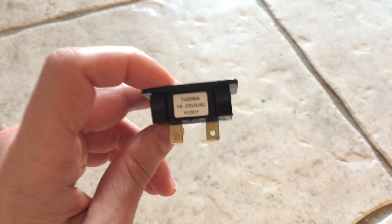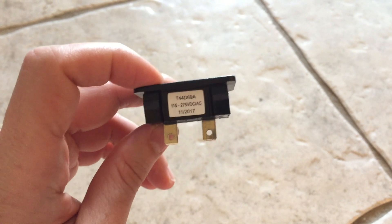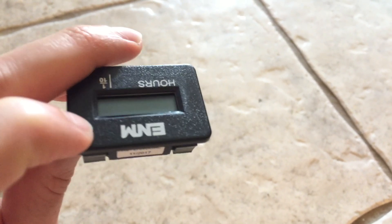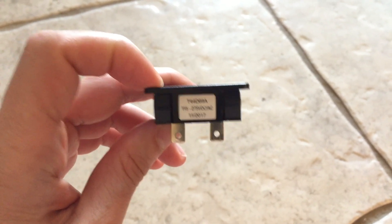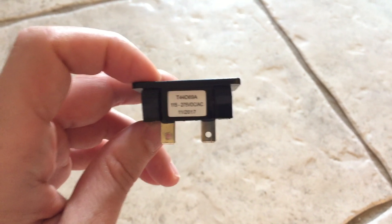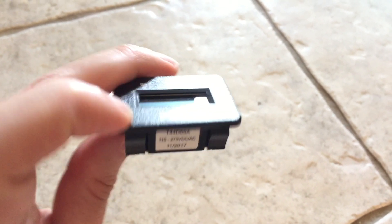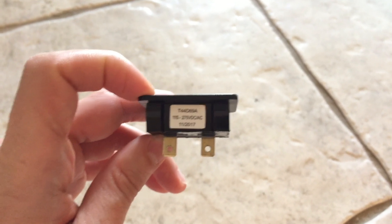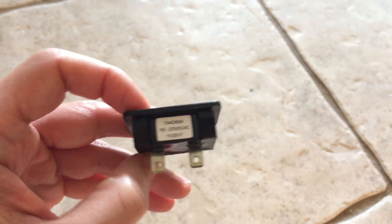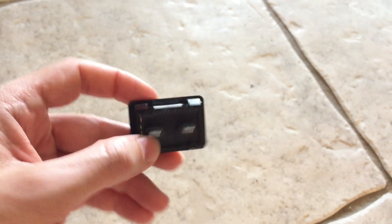Here you can see a few of the specs of the hour meter I'm using — the model number and that it's good for AC and DC. This is a panel mount unit, meaning I'm going to have to cut a hole into the unit somewhere with a Dremel tool. If you don't want to modify the case at all, I think this vendor E&M makes a version you can stick on to the top of the unit. But I decided to cut a hole and go with a panel mount so it's flush on top. This is a sealed unit — it is non-resettable, meaning you can't set it back to zero. So once it's hooked up and installed, it's there for good. The downside is that to view the number of hours you have to run the generator — there's no way to turn this on unless the unit is running. The upside is that this is sealed and there's no battery in this. This one has no battery, nothing to go bad, and the memory chip in here is sealed in.